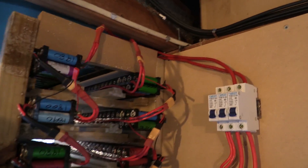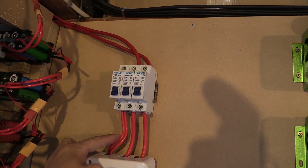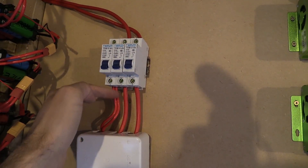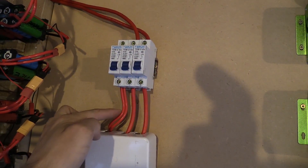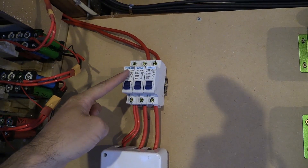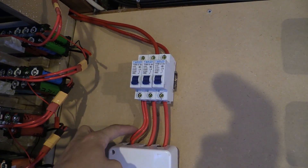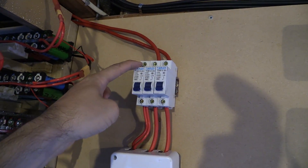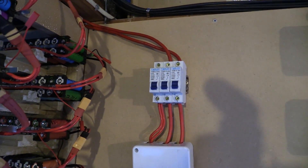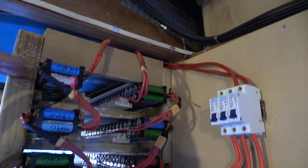I've just connected that up. I've actually connected it to the second one mainly because this is an 8 gauge cable, this is an 8 gauge cable, and this one here is two of the 12 gauge cables. This one looks very slightly longer than the other two, which are exactly the same length. So for now I'll just connect it up there and I'll move it across later. Let's keep it exactly the same for now since we know those are exactly the same. If I do use the slightly longer cable going through this circuit breaker I might have to shorten that lead very slightly. Either way, I've connected that up and put the wires at the top here - I'll clip them up nicely later.